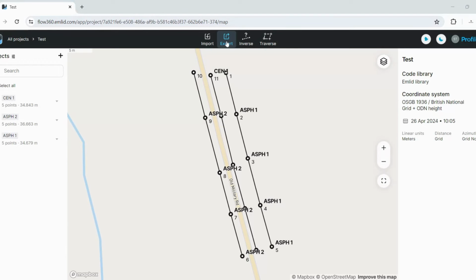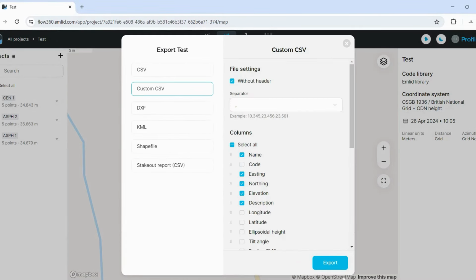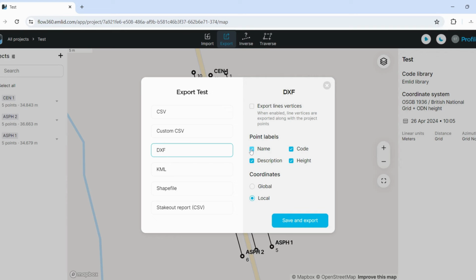and press export. I usually export as custom CSV on this format that you can see on the screen and put my codes in the description section because I found it quicker and I use a survey software that uses this format. Now we will export the DXF file, leaving just the height and coordinates will be local. Save and export.